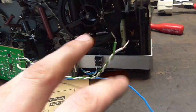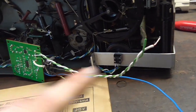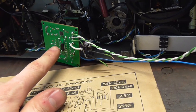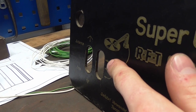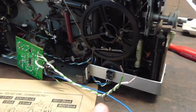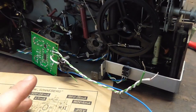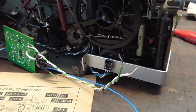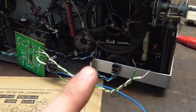Next up, the speakers. Usually, this circuit is designed to be hooked up directly into a speaker. However, I want to boost the low output power of this thing by using the amplifier in the radio. And that's going to be done by soldering the contacts of the PCB into the record player circuit of the radio. That means we're going to run this thing with no ballast load over here. And that's not good long term. It's like revving your car in neutral. It can be done, but you shouldn't. So I'm going to have to cobble up something to compensate that.